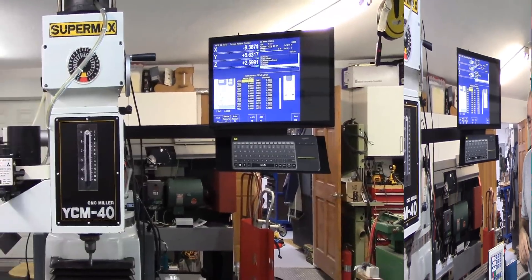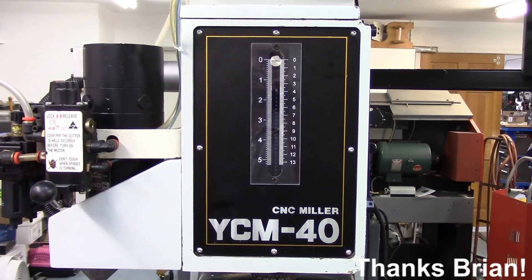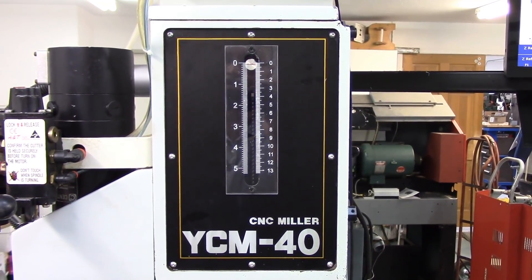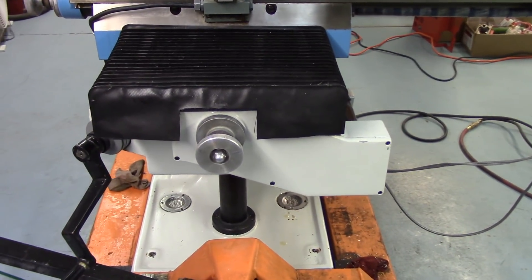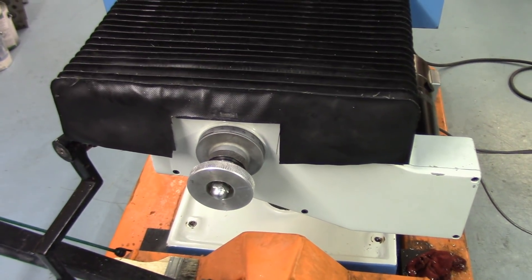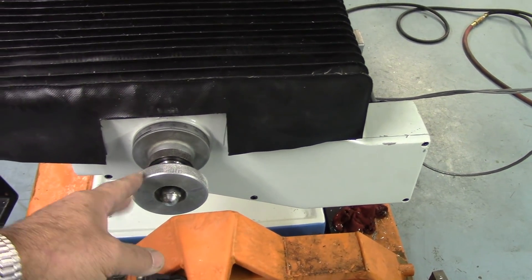Going handheld around the machine — there's the console and the keyboard, and the power draw bar. A good friend of mine with a laser engraver made a new plate with graduations for inches and centimeters as a visual reference — he marked and cut it with the engraver and used acrylic paint on the backside to make them visible. There's the TT1, the way cover installed, and the Y-axis cover. The small hand wheels are there — if you do a conversion like this you don't want large cast aluminum wheels because the inertia can actually damage the control.